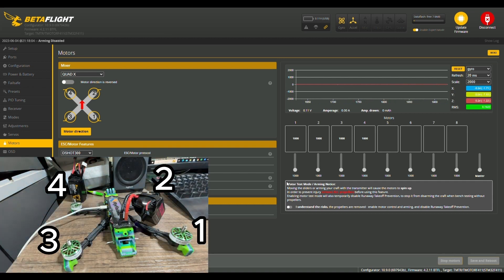Make sure you don't have any propellers on, because you might cut yourself. Click 'I understand the risk' and bring up number one to see if it spins. You can see that it's actually motor number three that's spinning — so we've got them completely mismatched. When we bring up number two, that one spins instead. So motor one should go to three, and two should go to four. We get the idea.